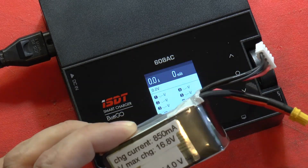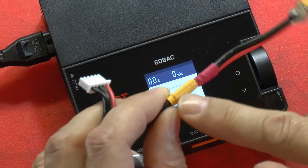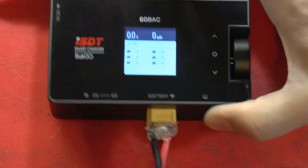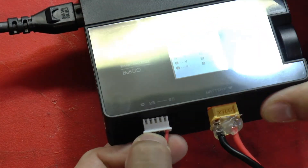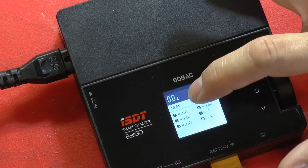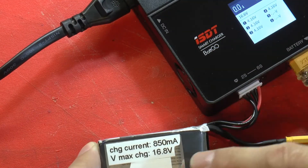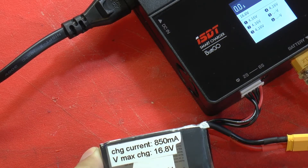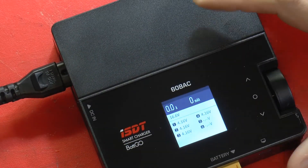Now I'll show you how to charge the LiPo pack. It's done the same way — you take your battery pack, plug it into the charge connector, put the charge connector into the port, and then take your balance plug and plug that into the front. We get the same kind of display — 16.6 volts is what it shows now. Its maximum charge is 16.8 volts, and dividing that by 4 gives 4.2 volts per cell. The charge current is 850 milliamps.